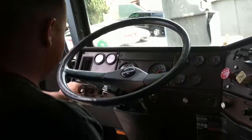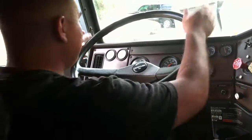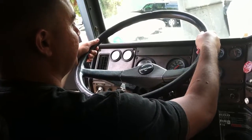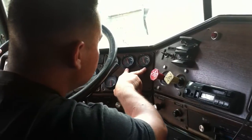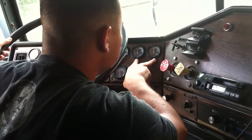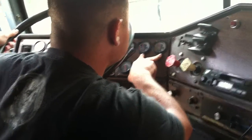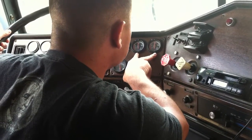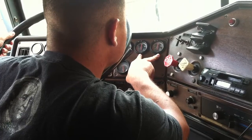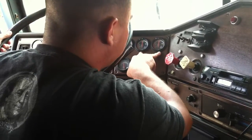Watch out and fire it up. My first test is my governor cut-out. My governor must cut out no higher than 130. My governor cut out at 120 on my primary. My governor cut out at 121 on my secondary. I know this because my needles stopped rising.